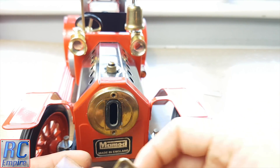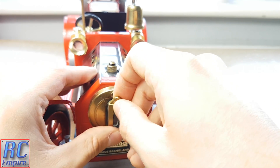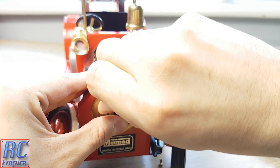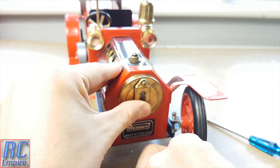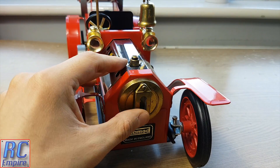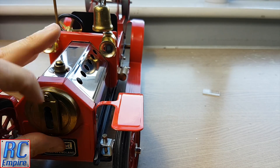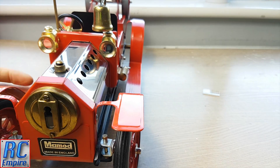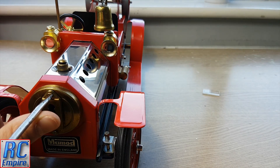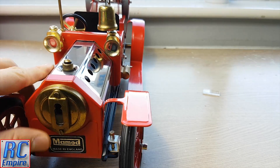Get your new glass, place it into the cover plate, and hold it onto the rubber. Get your brass screws and screw the plate back on. You really don't need to over-tighten this — if steam or water is leaking from it when we go to fire it up, you can tighten it up a bit more then. But do not over-tighten the screws because they might squash and deform this thin brass cover. And that is it — it is as good as new, ready to go, and looking amazing.